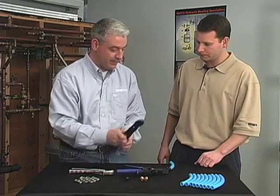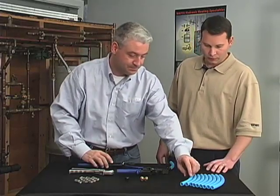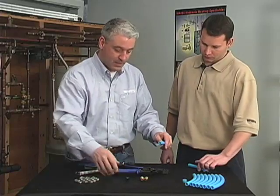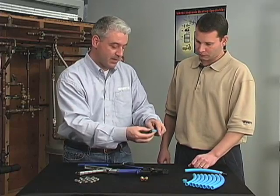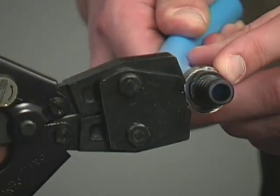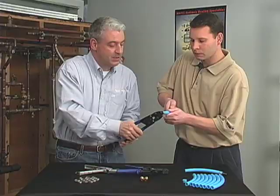The other type of tool is a two-handle. It's a little bit more difficult to use because you've got to use both hands and you won't have the ability to maneuver that cinch clamp. Start with your pipe, make sure it's cut square. Take the cinch clamp, place it over the pipe, and insert the fitting. Open the ratchet tool completely, insert the ear of the cinch clamp, and you may have to wiggle it just a bit to get it into position. Once in position, come all the way through with the tool, and it will release itself when the cinch is done.